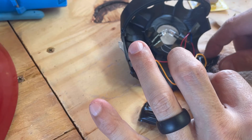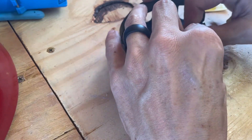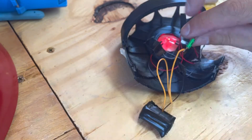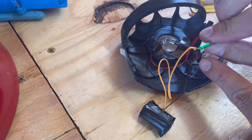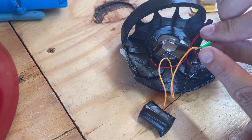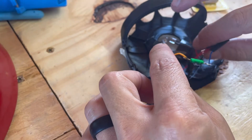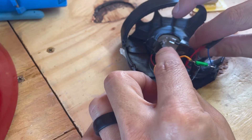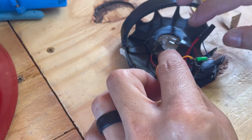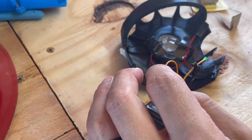What we're using is called a ball bearing tilt switch. This is a little sensor switch that has a bearing in it. There's a very tiny little ball bearing inside. When you get it to a certain degree, that bearing slides and it touches the other end, which continues the circuit. So when the bearing slides to one side, there's no power going through. But when you get it to a certain angle, it slides over and creates the connection. You can actually hear the bearing slide when I lift my hand up — it touches the contacts and that's what turns it on and off.